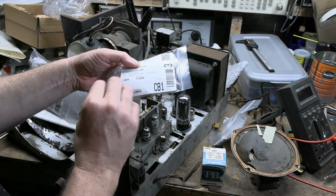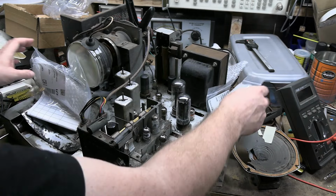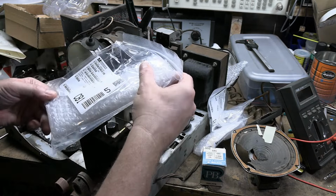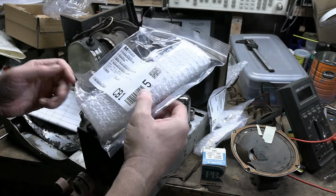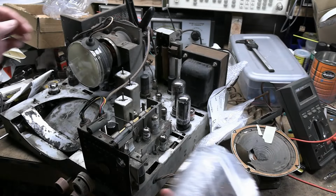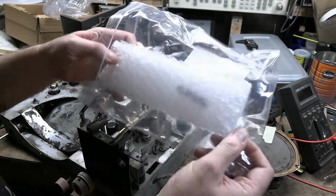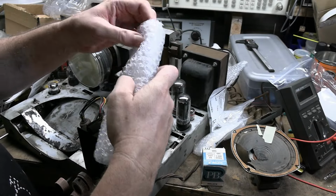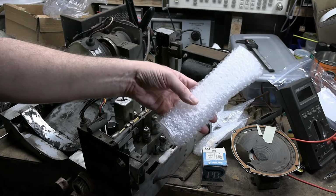This is a 25 watter, and here's a 50 watter, and, oh yeah, there's one through-hole resistor. I'm currently using the original in the horizontal output tube. I'm going to replace it with this guy. And yeah, I know, not great for the environment, but typically when you buy power resistors, especially enamel ones, don't be surprised to see them come like this.